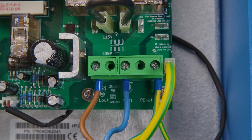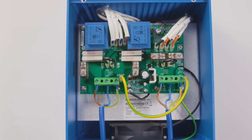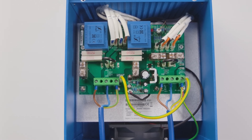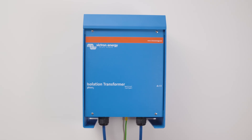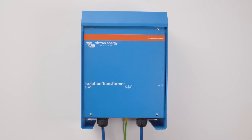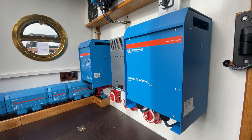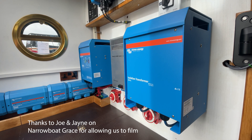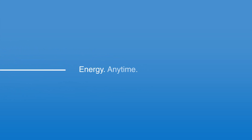Please ensure to read the manual thoroughly and to use a professional, fully qualified electrician to commission the install. With a number of power options available, the isolation transformer is the safest way to protect your vessel from corrosion by providing separation between shore power and boat electrics with either 115 or 230 volts. It will also provide maximum ground quality, which guarantees the best safety on board.